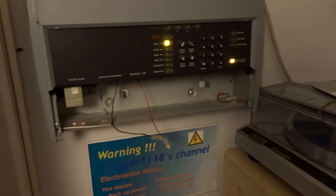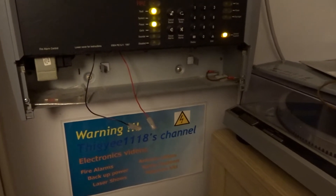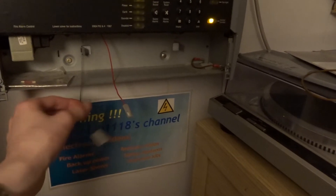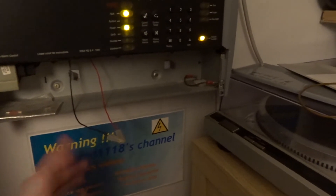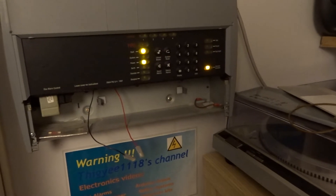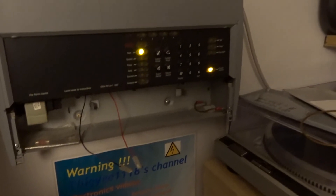So just disconnect them. If you're doing this, be careful — I wouldn't recommend having this hanging out because this could be a mains reference, although there's a transformer there. Depending on how it's done, it's probably isolated, but just be careful. Battery charging circuits in modern equipment can still be a mains reference because they're using capacitor droppers and whatnot.